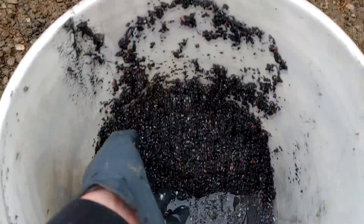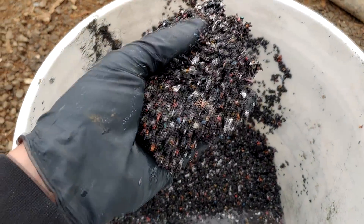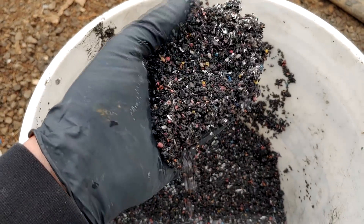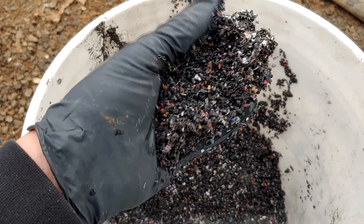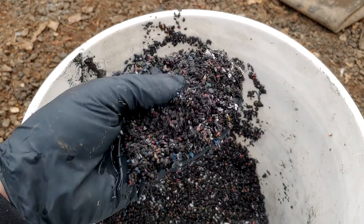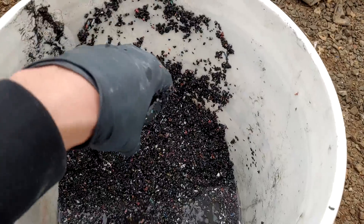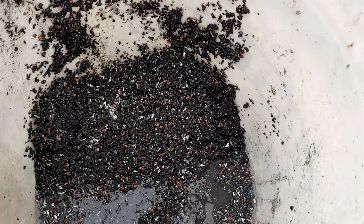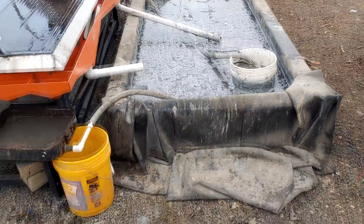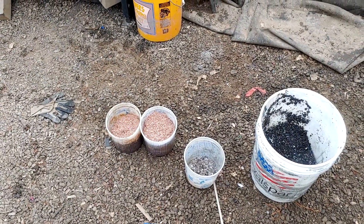Here I put a bucket under the number three middlings — this is mostly just heavy rubber insulation and aluminum, very very little copper. Mostly super fine copper wires if any, and again maybe you can tune the table a little bit to recover more of that. But it's probably not 0.1 percent of the overall copper in there, and I don't think the aluminum is worth going after. Whatever else just went into the tub there for recycling the water.